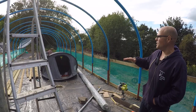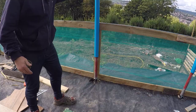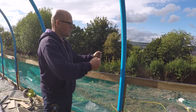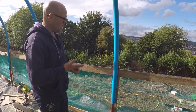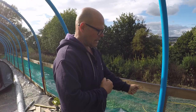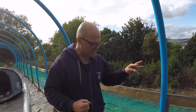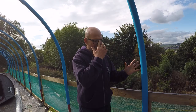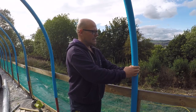We've used the technique of scaffold poles — just standard scaffold poles, about six foot long. If it hadn't been so rocky we would have just banged these in with a fence banger, but if you smash the top of a scaffold pole with a fence banger you will eventually break off the top of the fence banger. We did that twice. In the end we used a hole digger, tried petrol-powered boring but too many stones, so we hand-dug it and filled with post cement — about a third of a bag each. Then we put some WD-40 on and slid down 62-millimetre water piping.